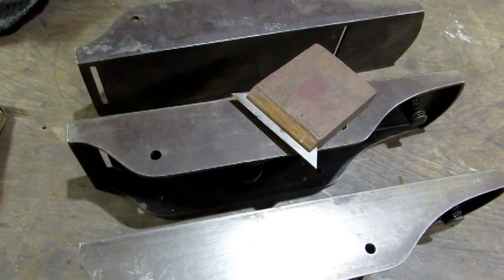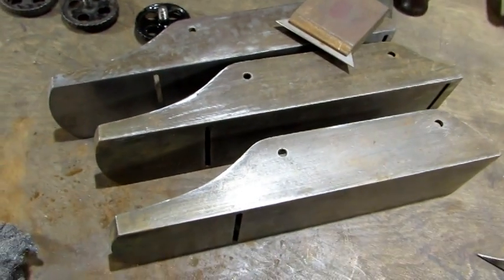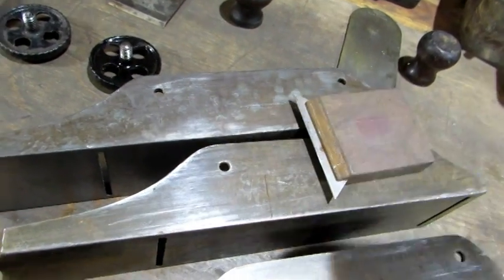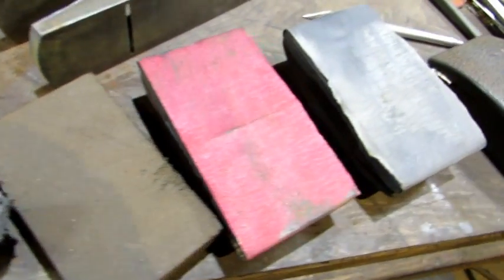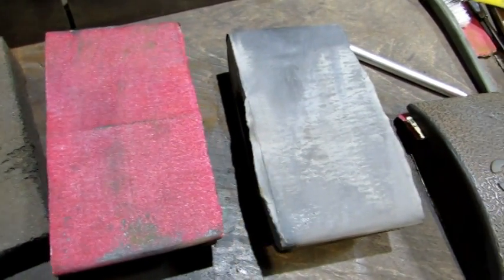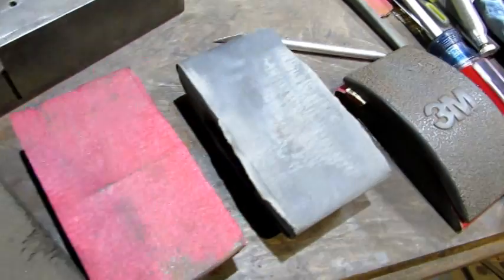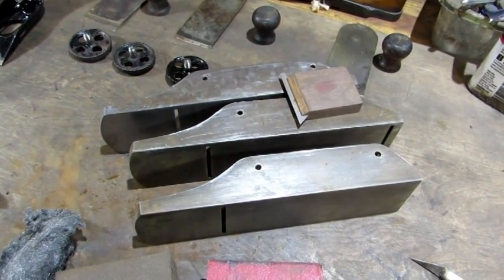They've got some surface rust on them but I want to see if I can retain the patina, so I'm going to use my scraper to remove that rust — it's a box knife blade with a burr on it. So the sides and bottoms have been scraped. When I do that I'm using just the edge; I hold my scraper at an angle while scraping, trying to keep the patina even. Next I'm going to use a worn piece of 150 grit paper on the sides and bottom, then an old sponge sanding block, then steel wool and 3000 grit — that should finish them up and leave some patina.